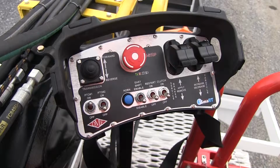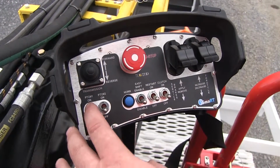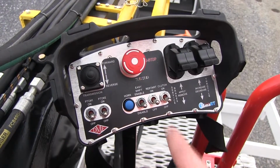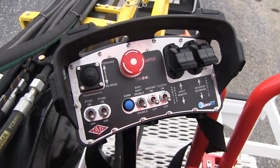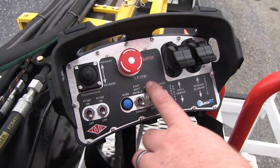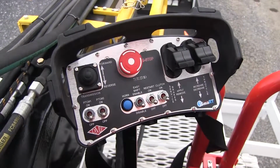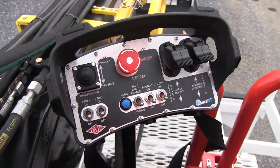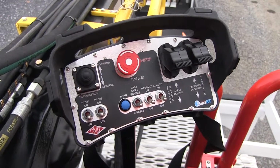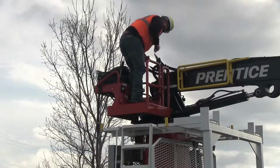To shut down the remote drive system, begin with the vehicle stationary and the parking brake set. Turn off the PTO. Press the machine stop button and wait 10 seconds for the remote drive shutdown sequence to complete. Note that pressing the machine stop button on the console box or the enable switch inside the cab of the truck at any time will initiate the shutdown sequence that stops truck movement, engages the parking brake, and turns off all remote drive functions. The engine will return to idle if it is running.